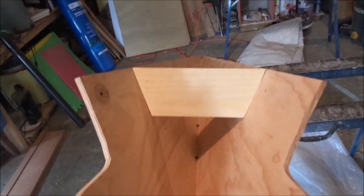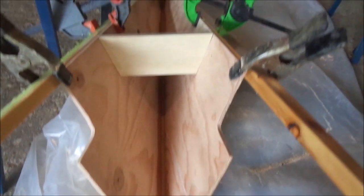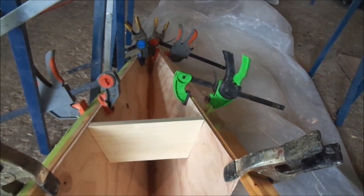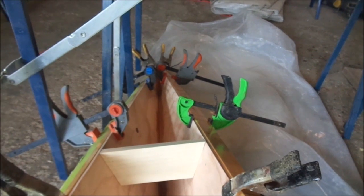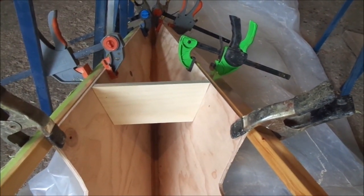This is probably too much of an angle — it will probably be more like this. I have a little brace in here, temporarily screwed into place, just for a dry fit, and everything seems to fit fine. I put a bead of epoxy resin mixed with some filler right down the center of the fairing — that should glue it together solidly. I have braces clamped on the side to keep everything straight, and when that hardens I will remove the braces and the center brace as well.